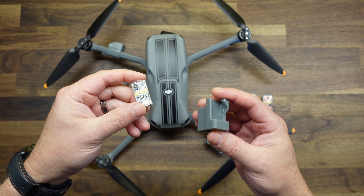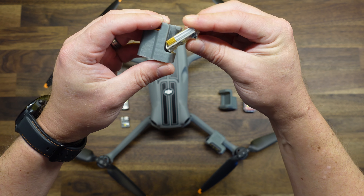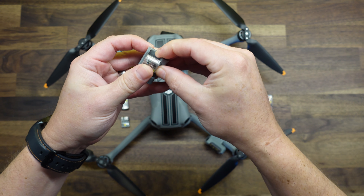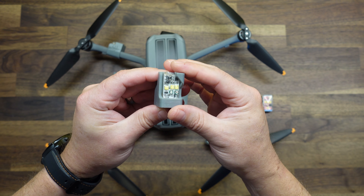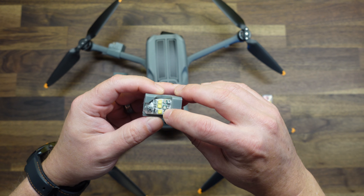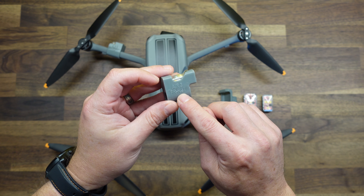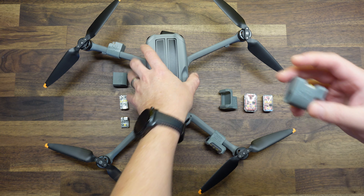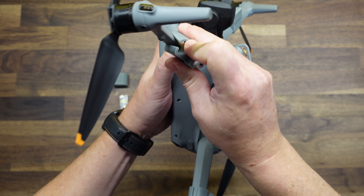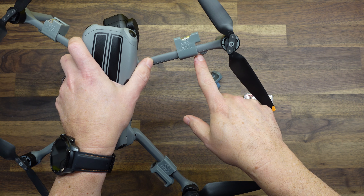Next, we're going to talk about how to install the Vifly strobes on the arms. The best way to install the strobe into the mount is with the charging port downward — tuck that into the bottom slot, pry the top catch back and tuck it in. That catch will spring back into place, as this is a rubbery TPU material, covering that top edge. You can see that all five LEDs on the Vifly strobe light are visible as well as the power button. Again, these are labeled — this one is front right. Text facing upward is how those are installed. Install it on the leading edge, slide it on until it clips into place and rotate around, just behind the front cushion bumper.